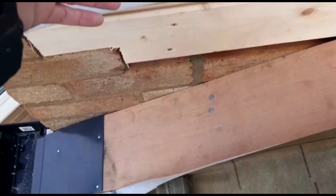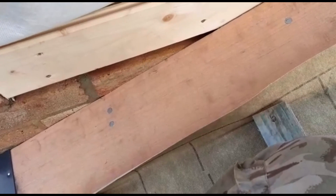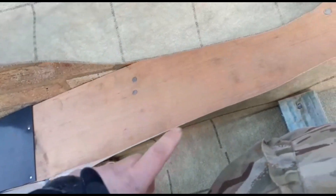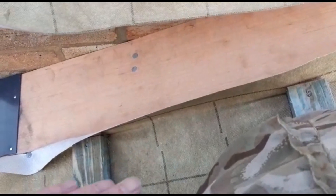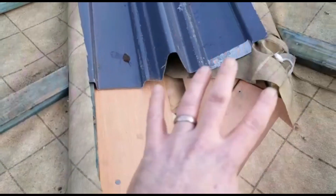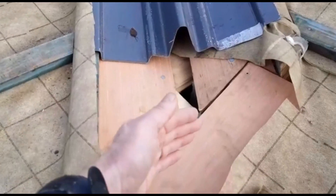I've just got to put the kind of lead composite material — in lieu of lead, but it's got a really sticky back. I've just got to get this cut, get it bonded in place, and then I can start putting the tiles over the top and get the cuts done. Then I'll finish this bit off here, get that valley trough put in. The rubber that goes as well will run into this bit I'm making here.